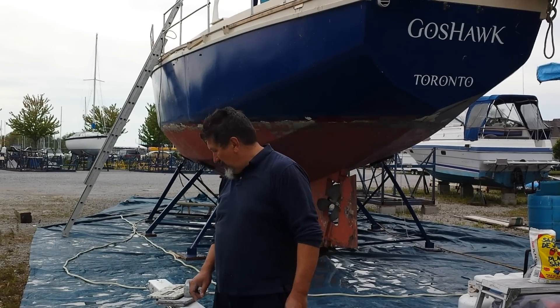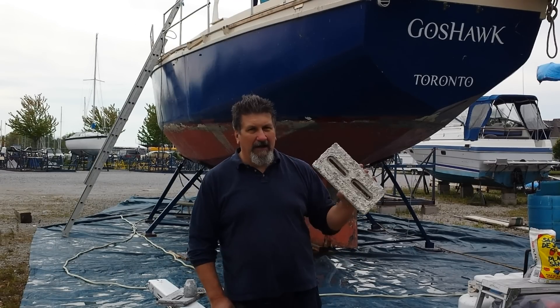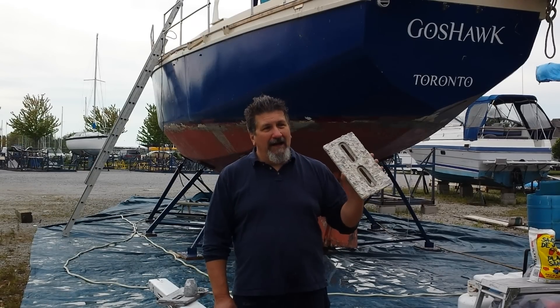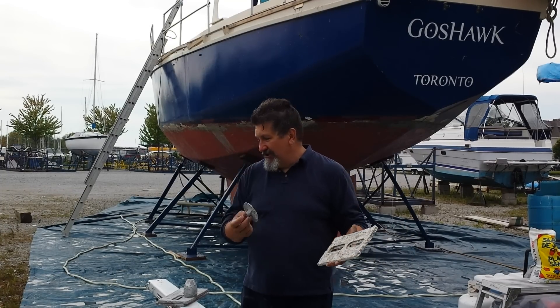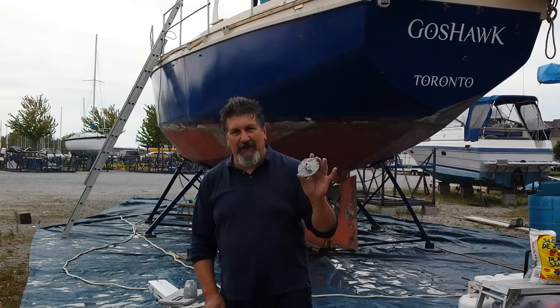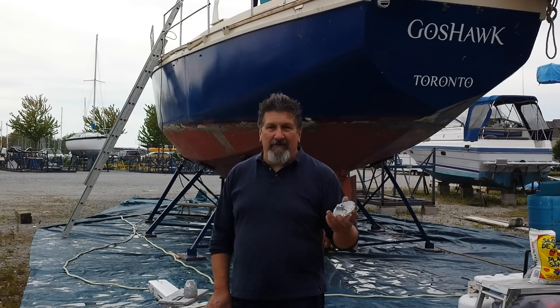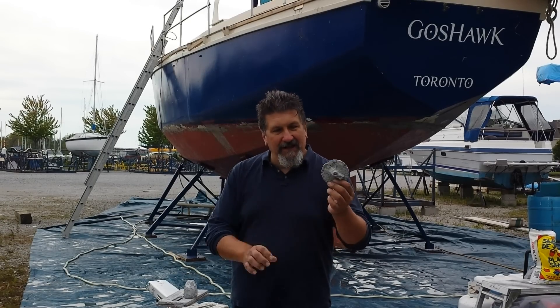If you saw the last video when we hauled out, you may have noticed the rectangular white patches along the hull line — you can actually see them on the boat. These are the Divers Green anodes. I've had six of these on the boat, as well as one on the prop shaft and one on the rudder — that one I found in the local chandlery, it's actually for a power boat, but I figured I'd put it just on the rudder itself, which is kind of isolated from everything else. If you look here, you can see this one has actually deteriorated quite a bit, and I'm happy to see this, because if these were pristine it would mean I didn't do it properly.